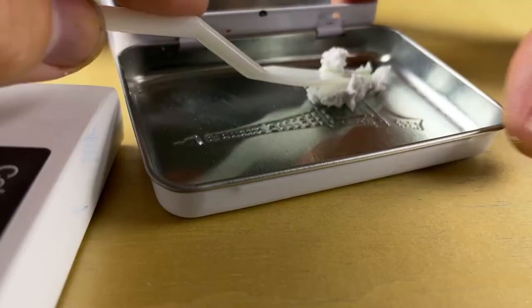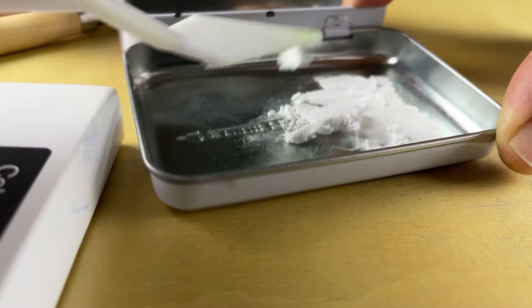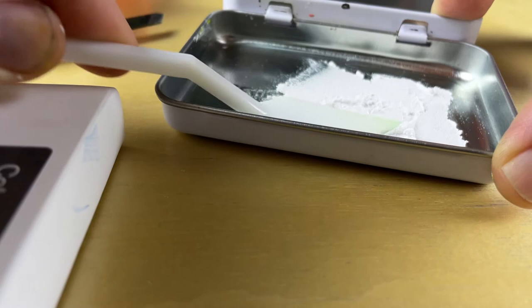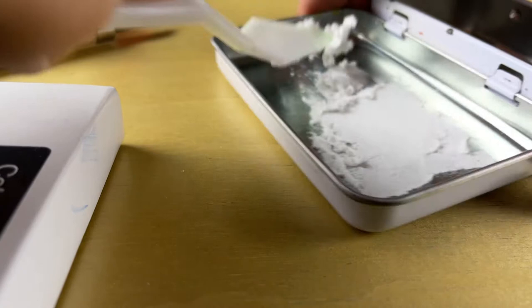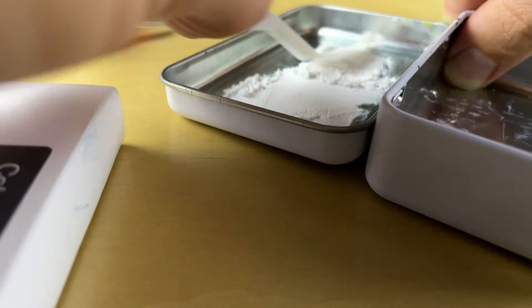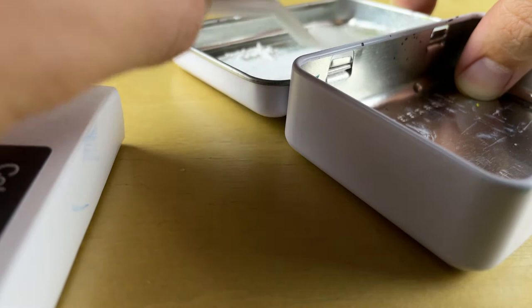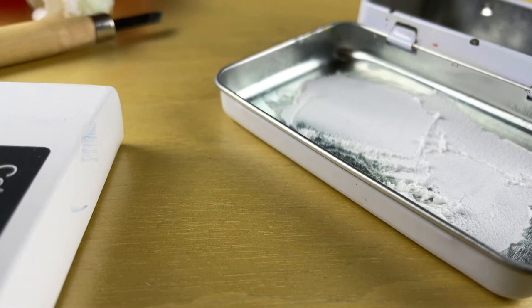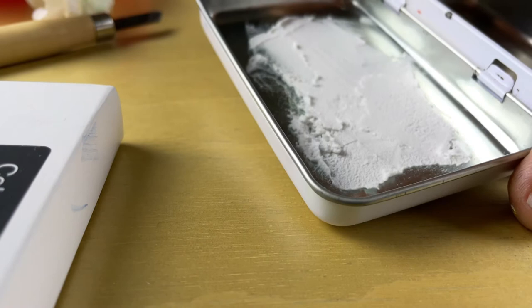This is the spackle — just the stuff you normally buy for fixing holes in the wall, easy to get at a hardware store. I realized this actually isn't the kind of spackle that you sand down, but putting a little bit of water with the spackle thinned it out and made it smooth and thin over the top, so that when you paint you don't get any texture from the spackle. I let it dry between painting and spackling — about 24 hours, though you could give it 48 hours if you want to be doubly sure.